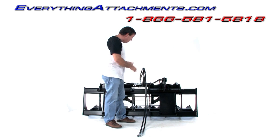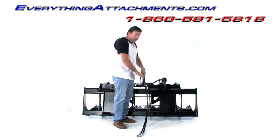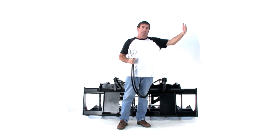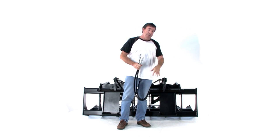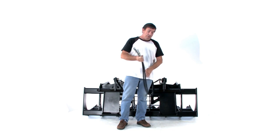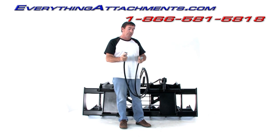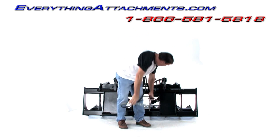We've put our standard hose saver kit with the swivel fittings on it, so you don't have to use longer hoses than you need to. If your tractor has the lines up on the side of the grapple like some Kubotas do, then you're going to need longer lines than to the center of the torque tube. So you need to let our salesman know that if you're not at the center of the torque tube of your tractor. These are standard half-inch agriculture fittings. That's what it'll come with unless you tell us something different. And I'm going to hook these together just so when I get around to the other side, I can lift the lids.